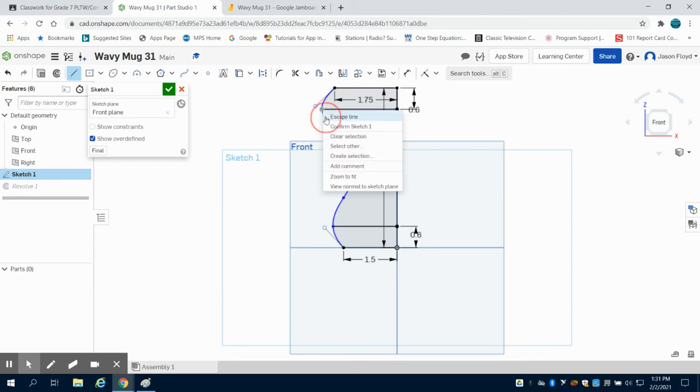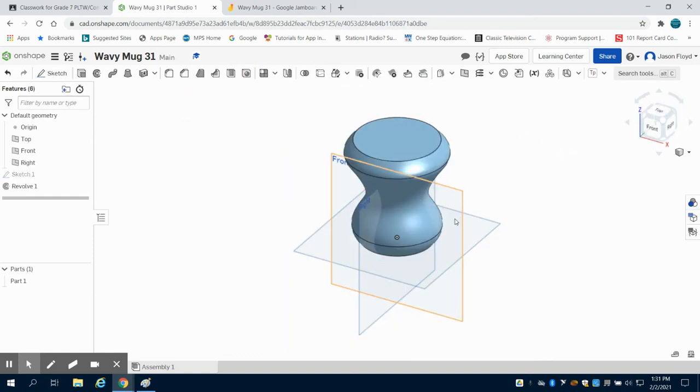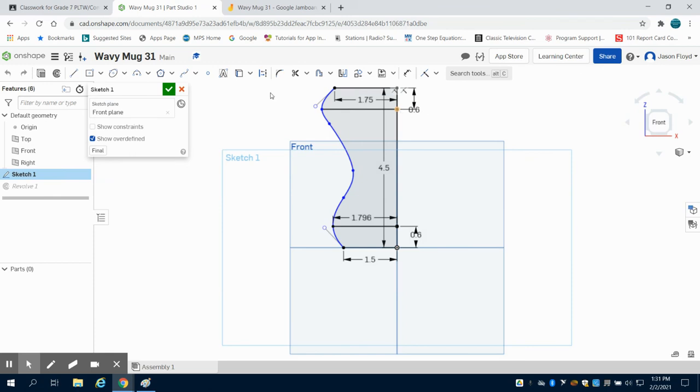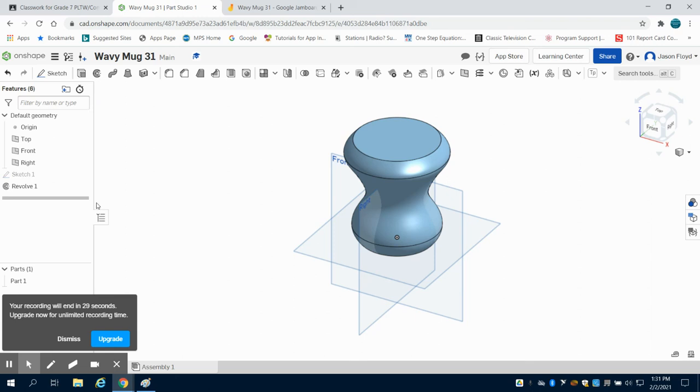So the top one is 2.109 on this example, and this is going to differ based on how you did your arc. And the bottom one we can see is 1.796. Again, this is going to be important when figuring out the radius to put our plane down. So you're going to notice I really didn't do anything in changing my sketch. I just wanted to find out where those points were. As you can take a look now, I have those points. And later on, if you don't like the design of the line, we can delete those off. So now that I have my measurements, I'm going to go about setting the planes to put my handle on, which I'll cover in the next video.